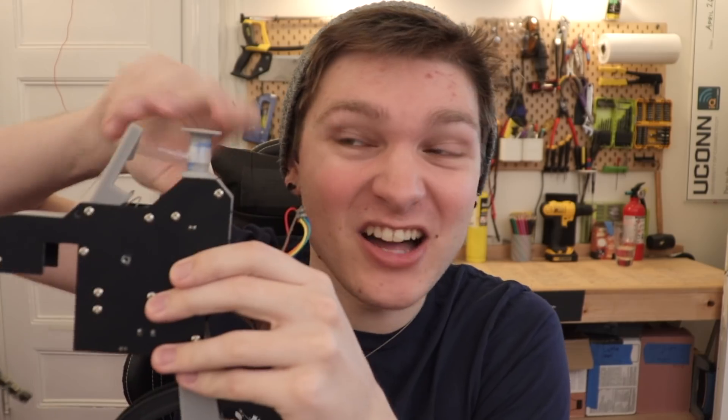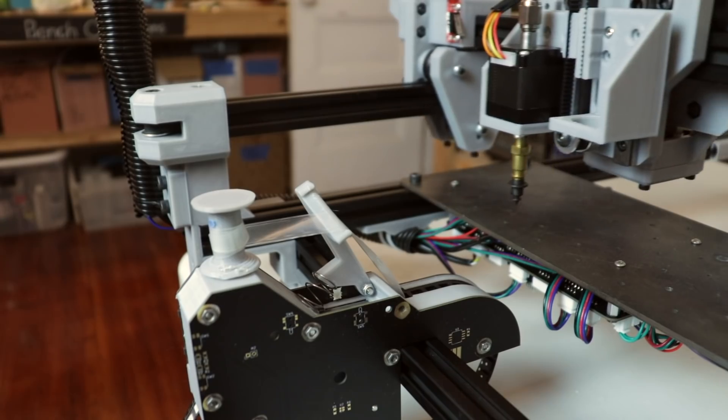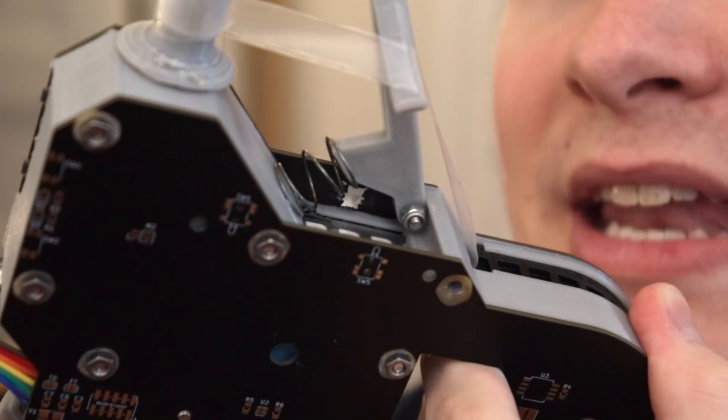However, there are a few very specific things that keep them from being entirely functional. The first and easily the most obvious problem is this stuff on top that handles peeling off the film — it 100% collides with the vacuum picking head while the camera moves over. So all this needs to be moved down and back a little bit to make space for the nozzle. The next issue is that the mechanical switch that detects tension has a lifetime rating of number of cycles, and if this is happening every time a component is picked forward, it's going to wear out pretty quickly.